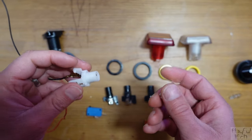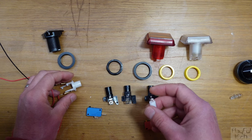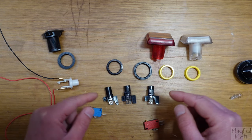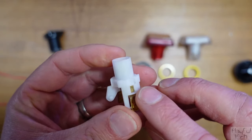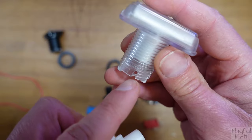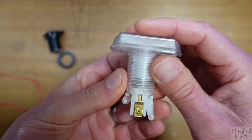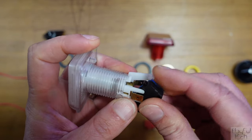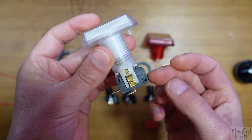There's just one more detail to be aware of, and this is the bit I find most annoying: there is no standardisation at all in the design of these bulb holders. I've got several different styles here and although they look very similar, they're not interchangeable — you need to use the one that matches the button you're using. For example, this white bulb holder has circular nodules on the side that mate with holes in the side of a specific button style. Even if you don't want to install an LED, you still need to install the bulb holder because that's how you attach the microswitch into the button.